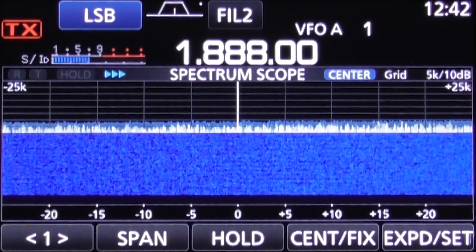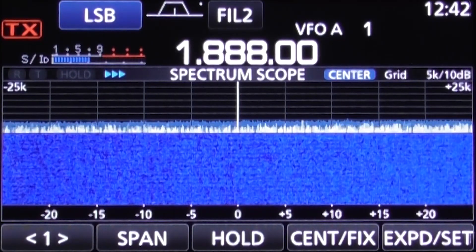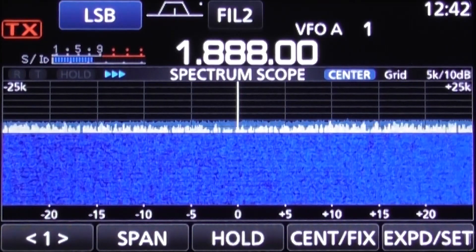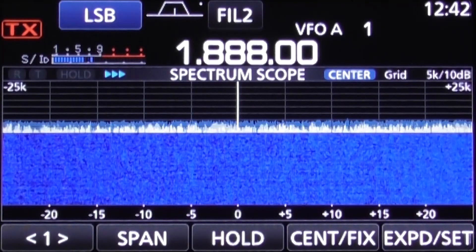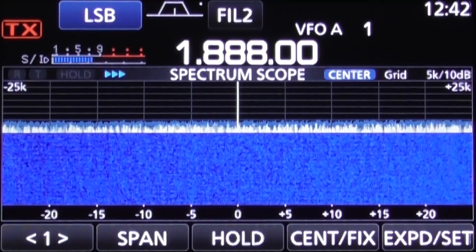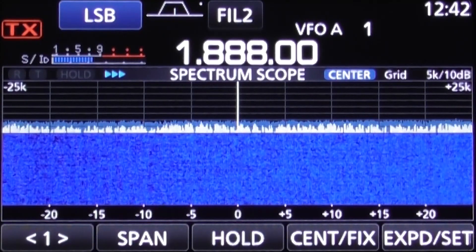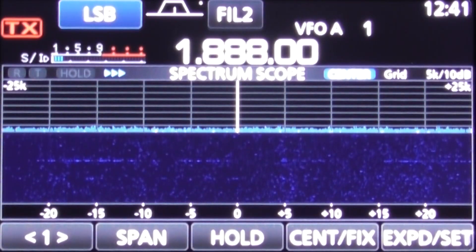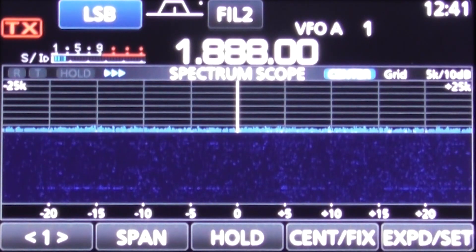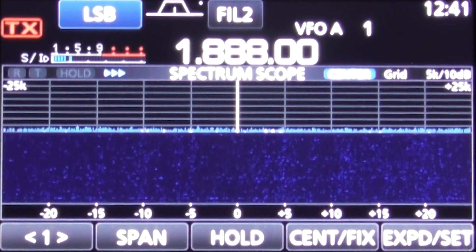What you're looking at now is my ICOM IC7300 on top band, powered by a Diamond GSV3000 power supply plugged into the mains with no filter. As you can see, the S meter is around S7 and there's lots of noise on the waterfall. Now I'll plug the power supply into the filtered mains supply — as you can see the S meter has dropped around four to five S points, down to S2 to S3, and the waterfall shows a significant noise reduction.